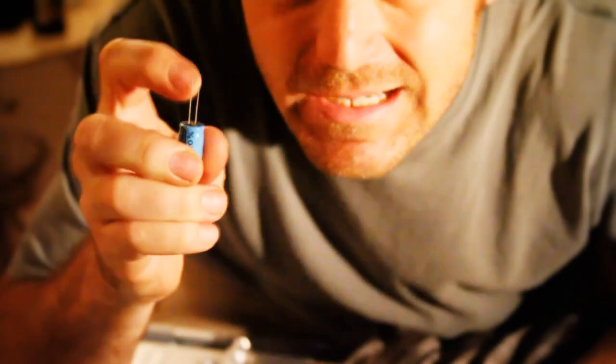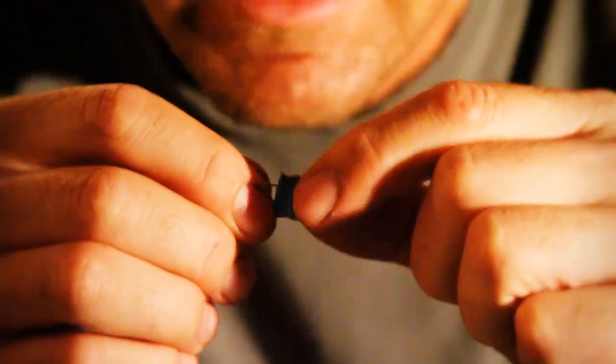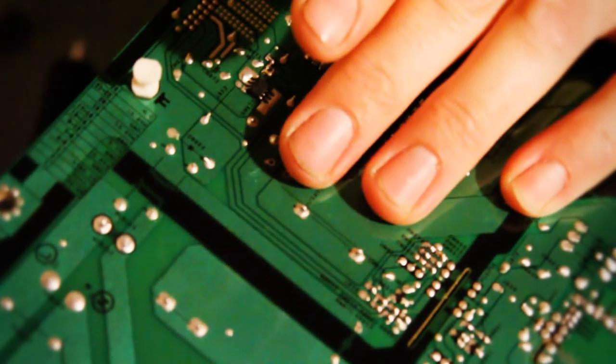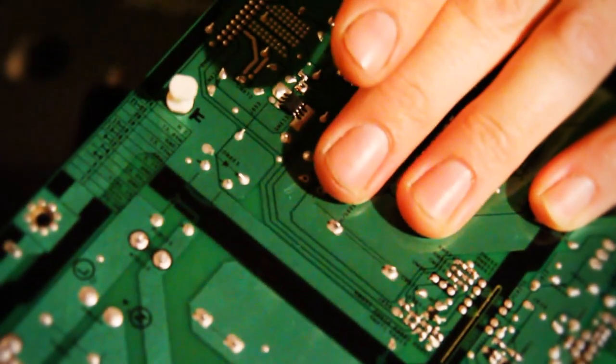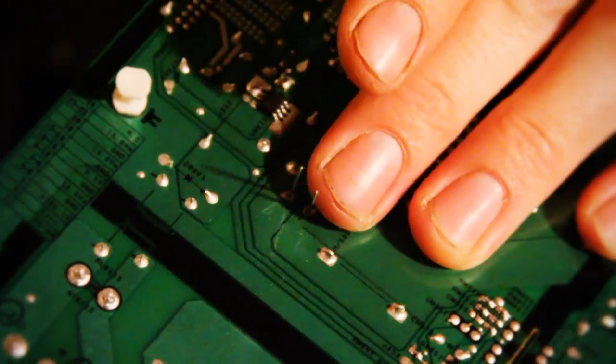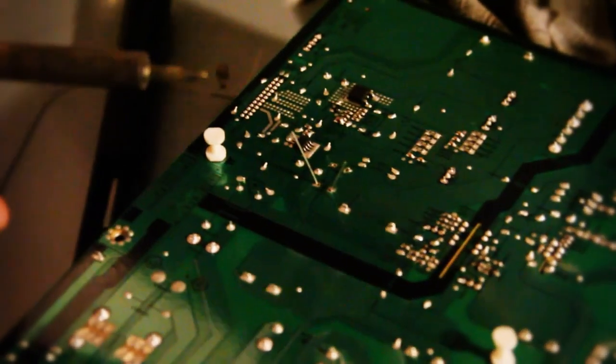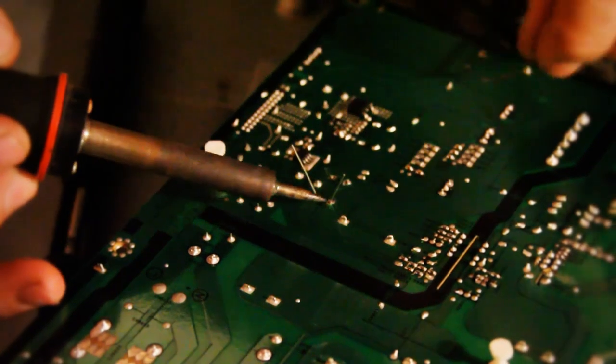Alright, what we're going to do — long lead positive, short negative. You can also double check the black line on the side of this thing. Negatory. Pository. Nothing there — okay, that's just the label of the cap. So that's what we've got to look for. Now we're going to feed it through the holes right here. Positive, negative — easy. I'm going to give this just a little splay so it won't drop back down.